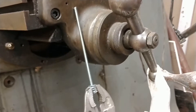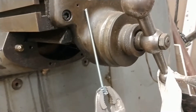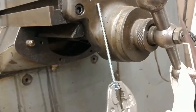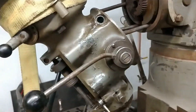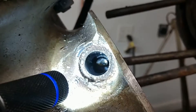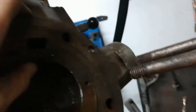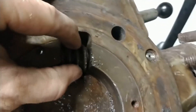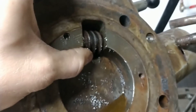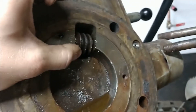That's exciting — not totally unexpected. We did start at 10/24, so we had the ability to go to 1/4-20 when this inevitably ripped out, broke, and otherwise just told me to go whatever. So here we are — you can see in the bore the shaft has come out a fair bit, we're definitely making some progress. The worm gear is starting to wiggle, we're very close, so I'm optimistic. Let me drill this out to quarter inch and tap it — maybe we'll be right as rain.